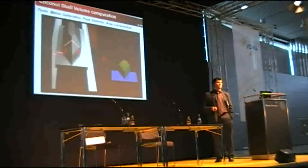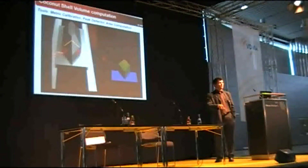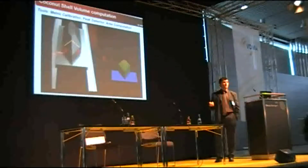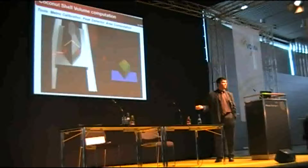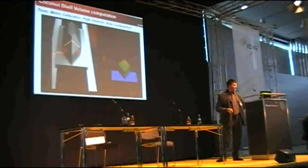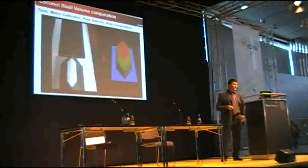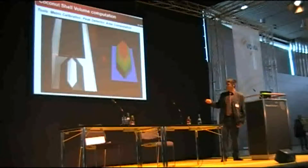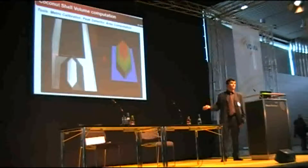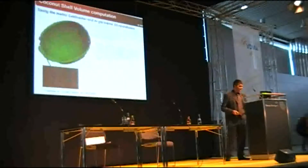The calibration of the system is very straightforward. The coconuts are supposed to be put on top of a conveyor belt and progress along it. The calibration uses a very standard object. You just scan it as though it was a coconut, and then the system is calibrated with very high accuracy. For you to see how it is, it's just progressing. After the acquisition, we get this, and because we already know the relationship between the laser coordinates and the effective manufacturing of the object, we know the coordinates of the vertices. Then we can put them in correspondence, and we get the system calibrated automatically without any interaction of the user. So there's no problem at all.